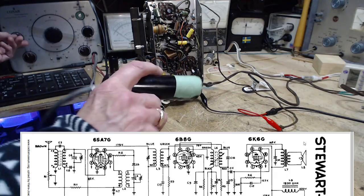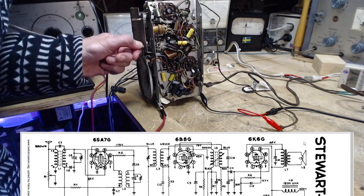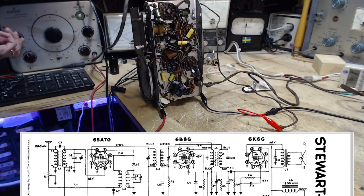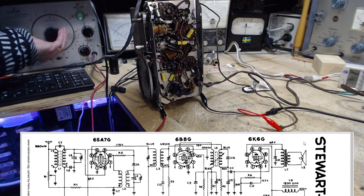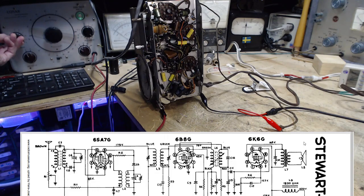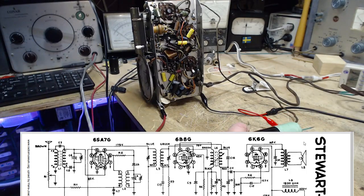See what we hear now. Oh, I have to have this up a bit. Okay. Now we hear it coming out of the tracer. The actual frequency is 455, as best I can tell. Perfect. So we have 455 coming into the top. Now that goes.